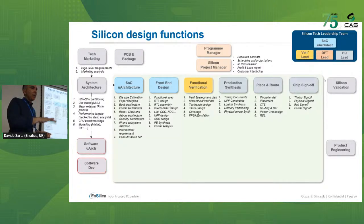So you run a quick synthesis, no DFT, no physical awareness, very, let's say, light, and look at the results. If they are under control, you don't need to close timing. So if there are violations, that's fine. But if you find that it is achieving like 500 megahertz and the target was 1 gigahertz, there is no point in starting implementation. Something is wrong with your RTL. Look at it, start again, analyze the critical path. Perhaps you may even conclude that there is a massive problem that you cannot solve. So you have to go back to the SoC architect and tell them, the problem you gave me is unsolvable. We have to do something here. So it's an important step.